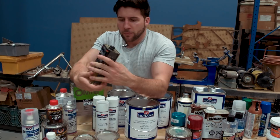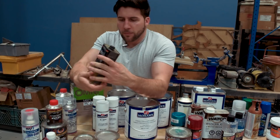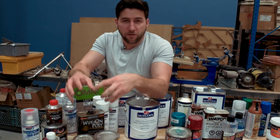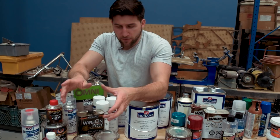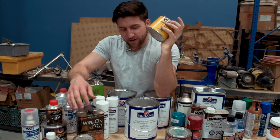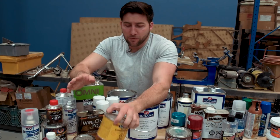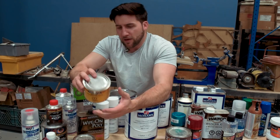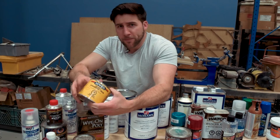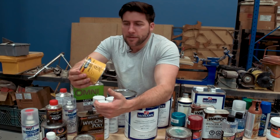And then there are a few outliers. You can do wipe-on polyurethanes — I've demonstrated this in a couple of videos and my viewers who have used it have had great success. My video on how to get a perfectly smooth poly finish covers a hand-rub polyurethane finish. It's very easy to use, hard to screw up, has a fair bit of durability, and makes for a nice finish. Wax — you can do a wax finish, believe it or not. I did it on a Telecaster not too long ago and it turned out beautiful. There are different kinds of wax — this is just a paste finishing wax, but you can also get a micro-crystalline wax. Easy to apply; I like to apply it with a little bit of heat so it soaks into the wood. It's not as durable as most film finishes, but it's very easy to repair and update.